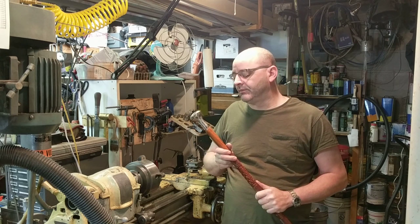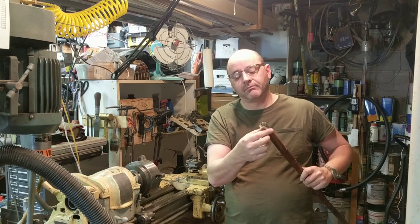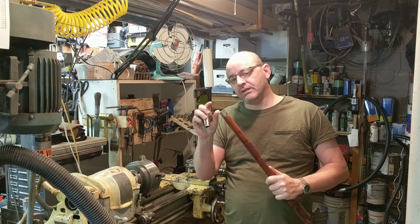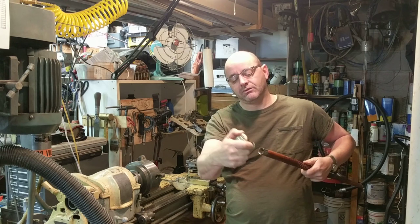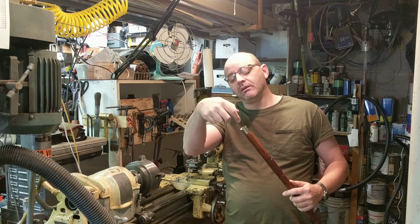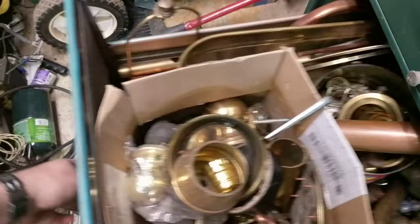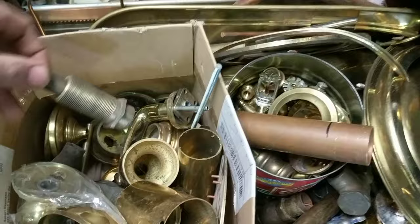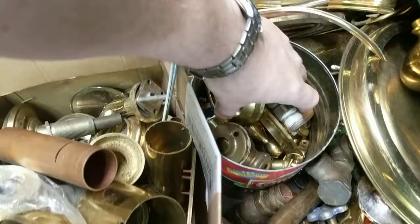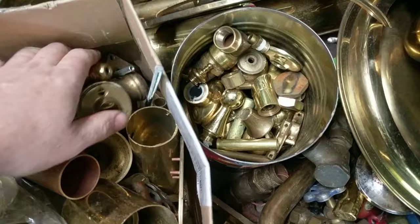I think I want to go a different direction. The way this walking stick is made, it has this brass ferrule that is attached to the wood - it's down around a tenon and then screwed down into there, and it's nice and solid. So I think what I want to do is create a one-inch extension that will thread into the ferrule and then have female threads to receive the head screwed into there. What we'll need is a piece of brass that's give or take the same OD as this so we can turn it down to match, then recreate the male threads for this end and female threads for this end, screw it into the extension and the project will be finished.